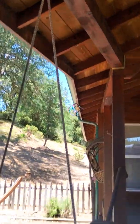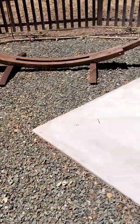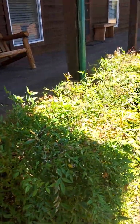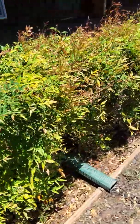Like I said, full wrapped around fascia here. You do not need a railing on this because it is actually 30 inches from ground. So California Building Code requires a railing when your plank to dirt level is more than 30 inches. This is exactly 30 inches. So there's no requirement for railing. Your home inspector would tell you to have a railing around here, and he'd be dead wrong. Same with the steps. There's no code requirement for a railing.